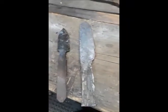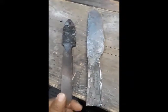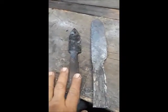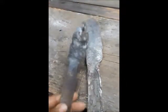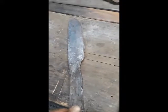There is a huge difference between the two knives — this one being forged and this one being the stock removal. Don't think one is better than the other because this knife is bigger and this knife is smaller; it's all by my choice. As you saw in the video, I took the opportunity to heat this one up and quench it, so now this one is hardened and this one is not hardened yet.